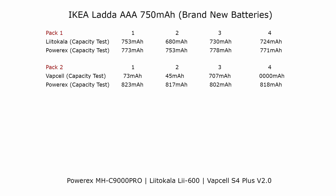I wasn't sure whether it might be a problem with the batteries so I did a capacity test in the PowerX and got great results. These batteries are rated at 750 milliamp hours and in the PowerX every one was charged to beyond 800 milliamp hours.